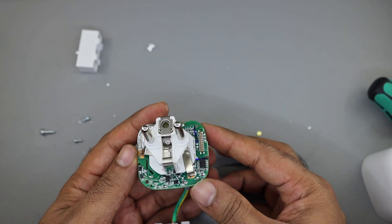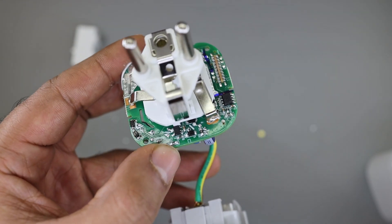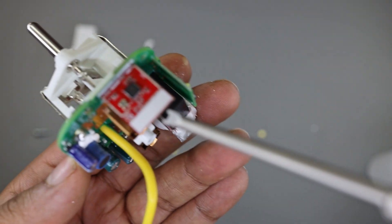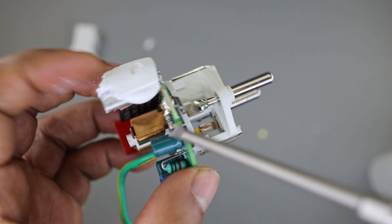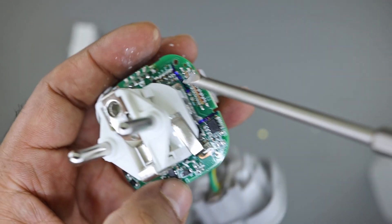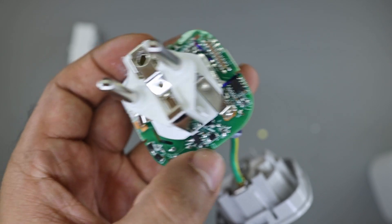On the PCB it looks exactly the same. And I can tell you that IKEA was planning this all along, because if you remember from the last teardown — I will attach photos of that PCB — this IC was missing last time. This is the power supply; we will analyze it. I will show you the exact part number of every IC here. This chip is of course the normal multiprotocol EFR32MG21 chip. This is the rectifier and everything else. The protection element, rectifier, and capacitor for rectification. There is a high-voltage to low-voltage DC conversion circuit, and a 3.3V regulator for the logic. This IC was missing in the Tretakt — the old plug which cannot measure power — and that is the reason why they have added this IC now.